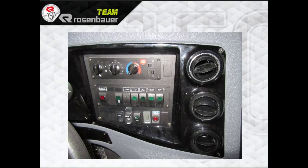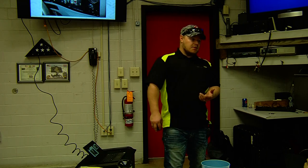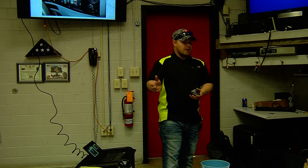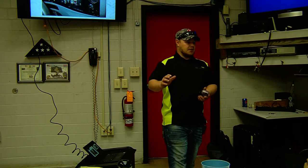Here's a picture from inside the cab. Your aerial and PTO switch is all one switch — flip it and your aerial and PTO engage at the same time. Same as your high idle: high idle is only going to kick up if you flip on your outriggers or your operating aerial; otherwise it won't just be sitting there at high idle.